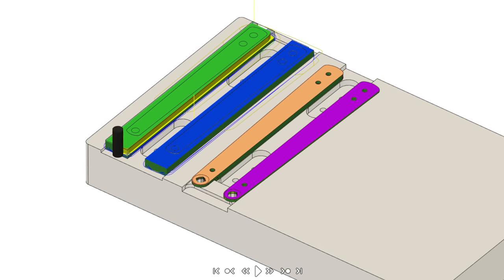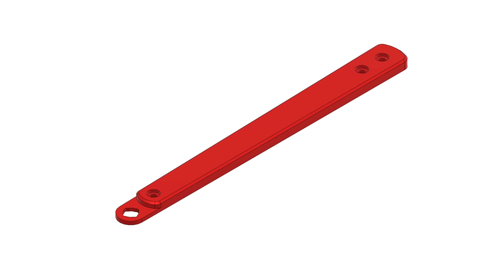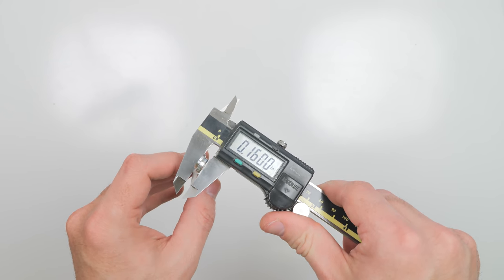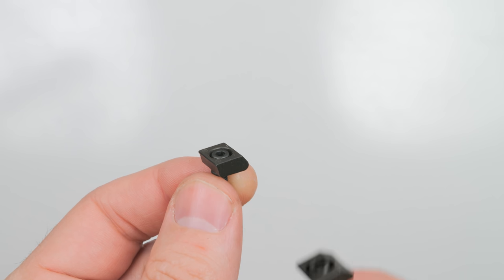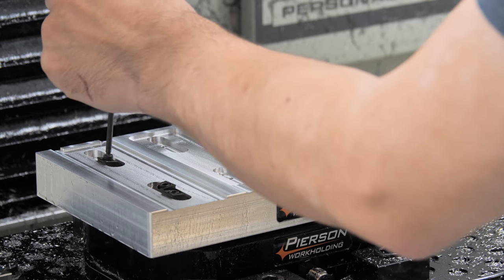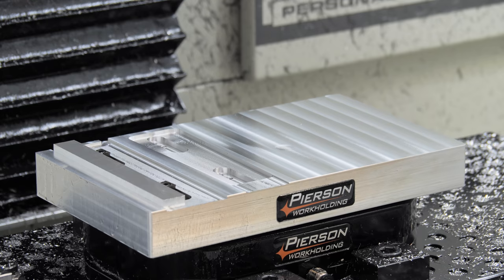What helps even more is less operations. Simplifying the shapes makes that easier. My parts are still fairly thin though. I've been using the smallest sized pit bull clamp. I wanted to switch to half inch clamps because I didn't like using the small screws. You can't torque them much without damaging the head or the threads.